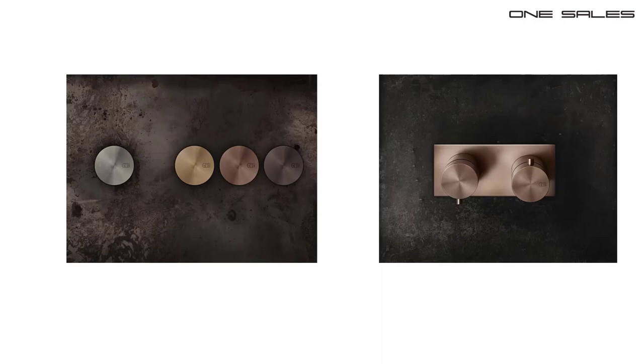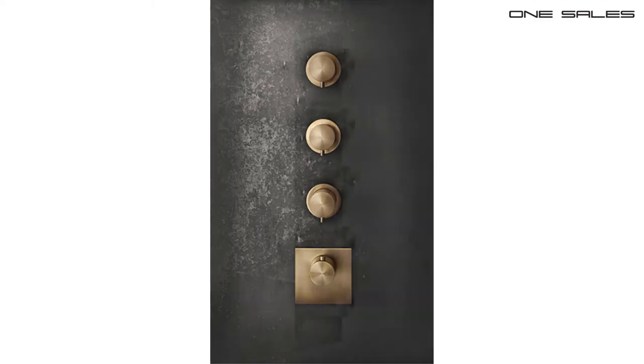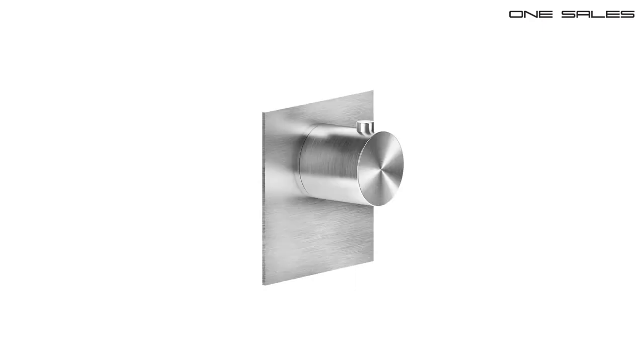This specific half-inch valve can only be installed horizontally, not vertically. What we're looking at here is the three-quarter-inch shower valve with three shutoffs, which allows you to run all three functions simultaneously, just one at a time, or one at full pressure and another at half — whatever you like. You can order this as a two, three, or four shutoff configuration. This is the same valve as the previous one, but with a solid trim plate. Here is the three-quarter-inch thermostatic trim on its own — you can order just the thermostat and shutoffs individually to build your shower as you please.